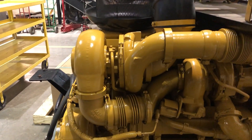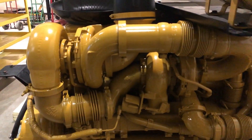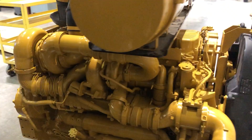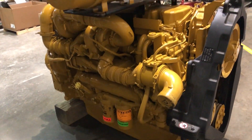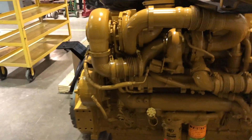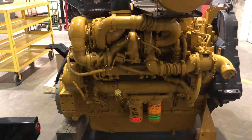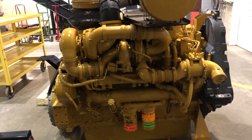Here's your whole turbo setup. The engineers — I don't like emissions on engines, but they did a pretty good job designing all this stuff to fit together like a puzzle. Look at how close some of this stuff is. One of the unique features about this C18 industrial engine is it has a pretty small footprint compared to other brands in a V configuration like a V12 or V10. So you can fit this in applications such as marine, concrete mulchers, wood mulchers that grind trees, wood chippers — you don't have to have as much room in the chassis because it's a really compact, powerful engine.